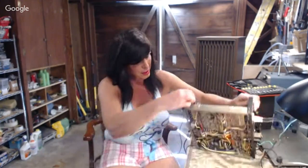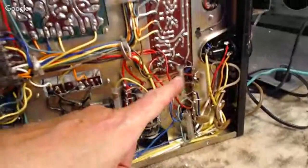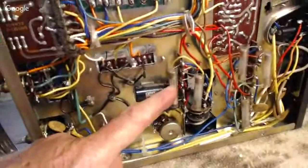But I want to be able to take time to get the schematic, understand a little bit about how the lighting circuit is running, go around, test some voltages and some other things, because it looks like one of those low board fuses has blown down underneath, the ones that we talked about before. They have a lot of these fusible links down here, showed you before. All these down in here. We need to understand the flow. Number one, time has made these so you really can't see inside of them. They've become fogged with time, so it's impossible to tell.